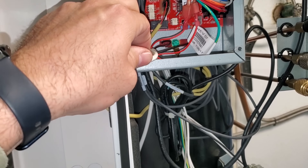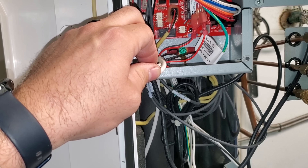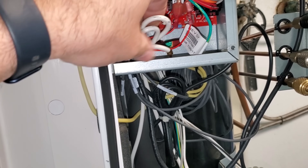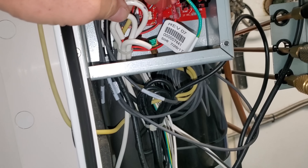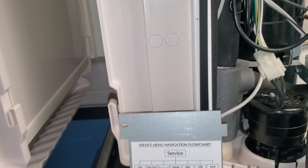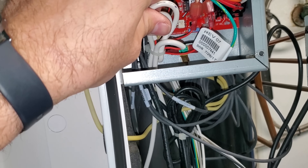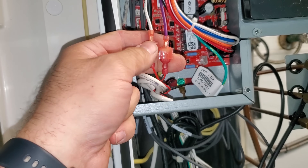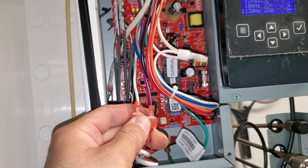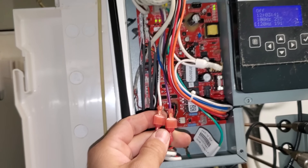Here's what's dumbfounding — these are OEM zip ties; these curtain switches have never been replaced. Nobody's ever changed these — I can tell by the zip ties. Unless someone flopped the plugs right here. But this machine's been here for over three years, so why now? That's interesting.